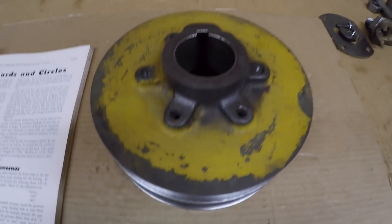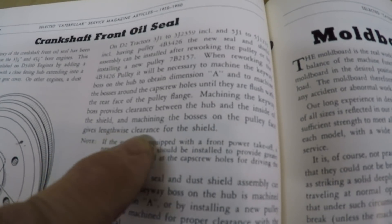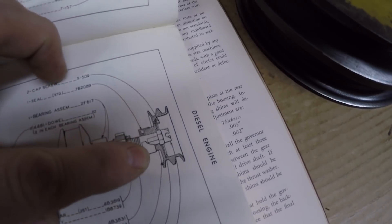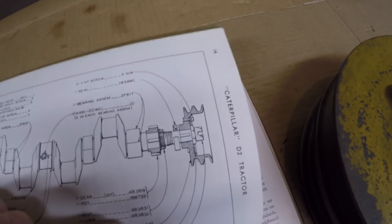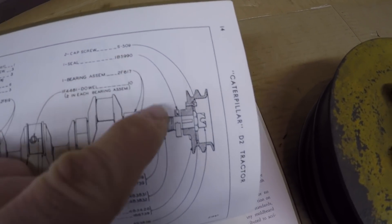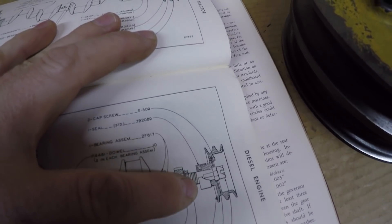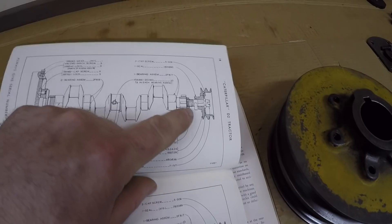So early generation, early pulley — before the dust seal improvements — has not been machined, has not been altered. Kind of a neat, still-intact first-generation piece. Machining the keyway boss provides clearance between the hub and the inside of the shield, and machining the bosses on the pulley face gives lengthwise clearance for the shield. That means this updated front seal with the dust shield could be used with this earlier pulley if all the necessary machining had been done. That's also why I could not find the 1B-5990 front seal through Caterpillar — not available, because it was very quickly superseded by the new design seal. That's why I had to go to the aftermarket to get that front seal.